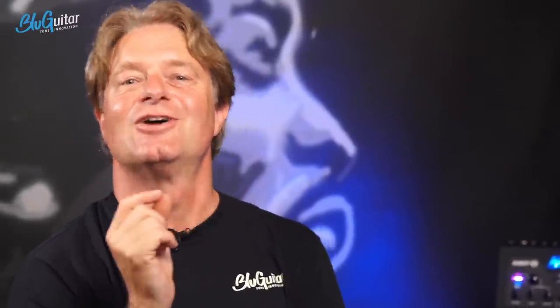How can we do it? We use modern technology, but we know what's happening in the vintage all-tube designs. So in the vintage power amp, we all see the big power amp tubes. There are probably four power amp tubes, EL34s or 6L6s or whatever. And these power amp tubes need a transformer, because the high impedance of the tubes needs to be converted into low impedance for the speaker. And before that, we have the phase splitter stage that splits the signal into the positive and the negative half of the waveform.